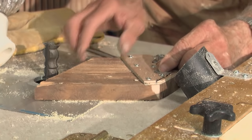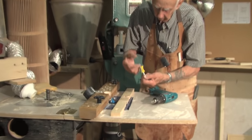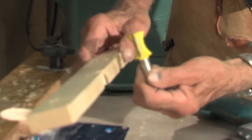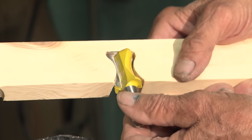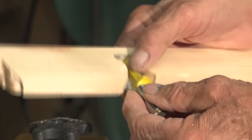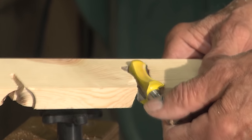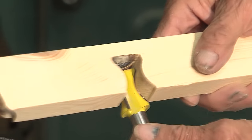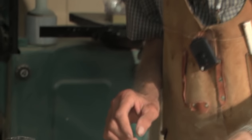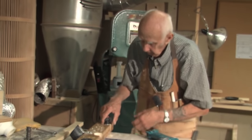Here I have a big cutter for the edges of drawer faces or shelves. Again I made a zero clearance fence because this bit also has no bearing on top. When they started making router bits with bearings that was a lifesaver — I'd worked with no-bearing bits for many years. But for no-bearing bits, zero clearance makes it real easy. Now I'm going to take this off and show you how I change the router bits. It's real easy.